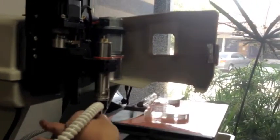Okay. Now, the longer you have it, the more that this might do this, right? It's called tool deflection. The thing is, it's a diamond scratching metal, and you don't have a lot of side force moving the tool, so you're going to be fine. Okay. So we've set our material.